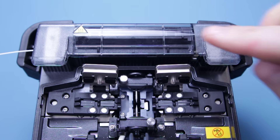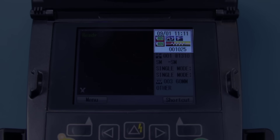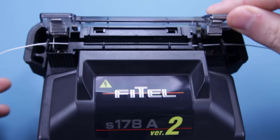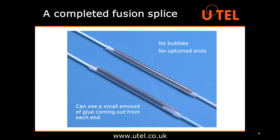If you haven't already, make sure you have closed the magnetic flaps and the dust weather guard down again to keep the fusion splicer clean. The machine will automatically start to heat the plastic. You will know it is working as the light next to the yellow heater indicator shines red and the heater symbol in the top right of the screen shows you the progress. You are able to change the heat settings depending on the thickness of the protective sleeve you are using. It is worth checking you are on the right setting before you start as you may burn your sleeve. When complete, wait 15-20 seconds for the glue to harden, then remove the splice using caution as it could still be very hot. And there you have it — a completed fusion splice. There should be no bubbles inside the protective sleeve, which would indicate overheating, or no upturned ends on the protective sleeve, which would indicate not enough heat. You should be able to see a small amount of glue coming out from each end. Perfection.